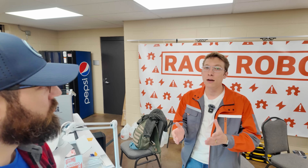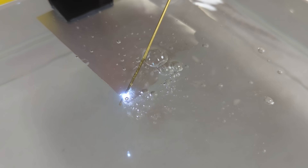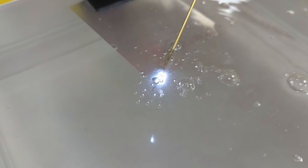Wire EDM is a subset of EDM machining — Electrical Discharge Machining. It's a non-contact, low-force machining process. It uses high voltage to initiate sparks between a tool and a work piece, and those sparks, going several thousand times a second, actually vaporize the work piece, creating plasma that's hotter than the sun. So you can machine any conductive material with this process right on your desktop.